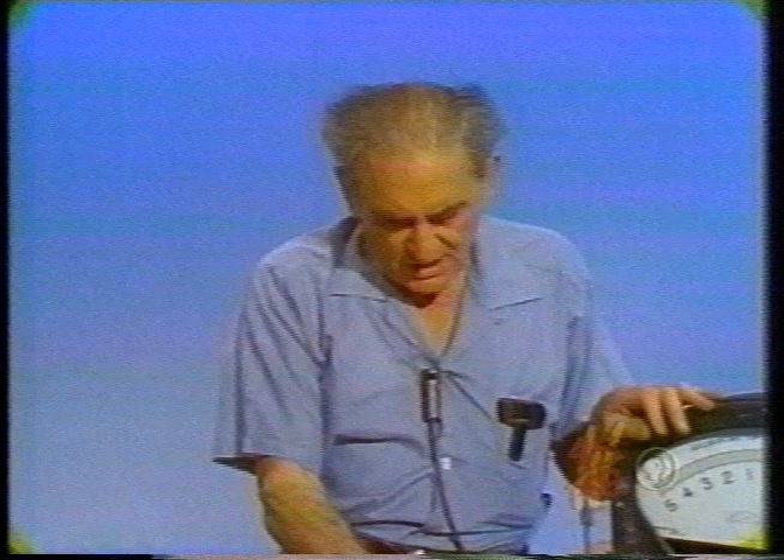Question. Can I get an electromotive force, a difference of potential, from a grapefruit? Yes. Can I get it from an orange? Yes. Can I get it from an apple? I won't answer that. And how about getting it from a potato? What constitutes a voltaic cell? Two different metals. Here I have copper and carbon. Here I have carbon and lead. As long as I have two different metals.